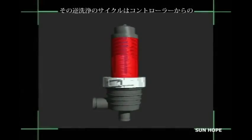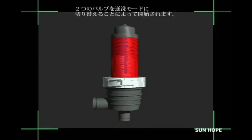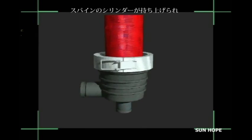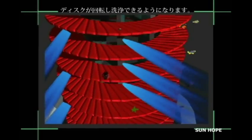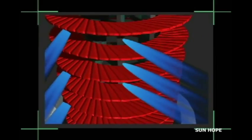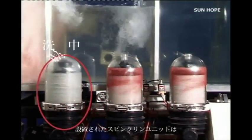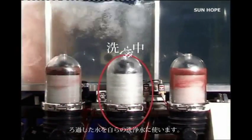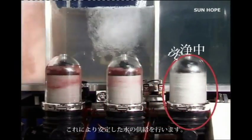The flushing is activated by a pneumatic or hydraulic command from the controller. This command changes the dual valve position to back-flush mode. The same command lifts the piston and releases the discs, which are now free to spin and clean. A number of SpinClean units installed in different configurations guarantee a constant supply of clean water as each filter cleans itself and flushes consecutively.